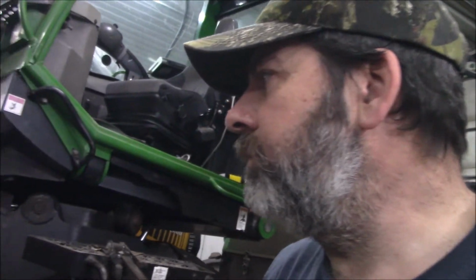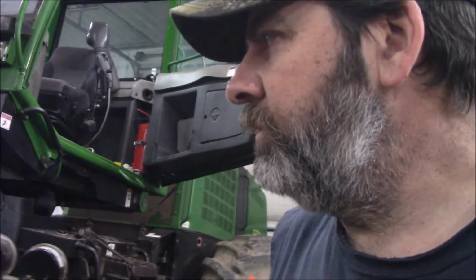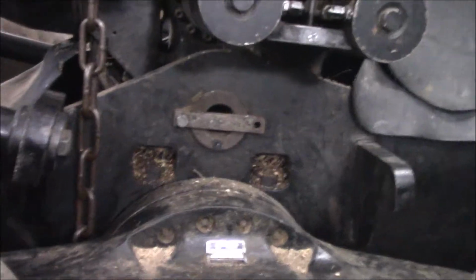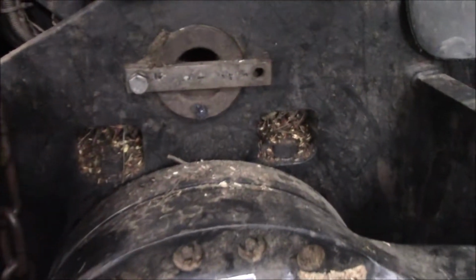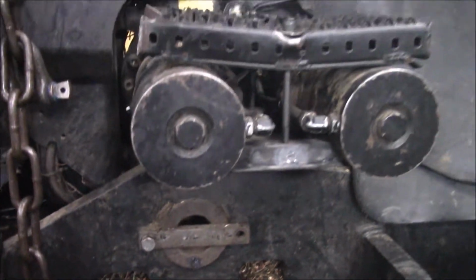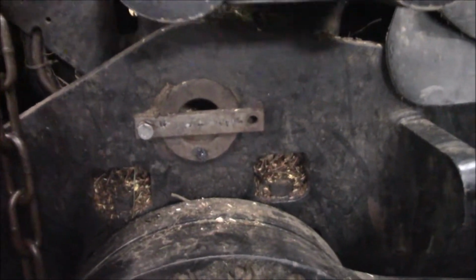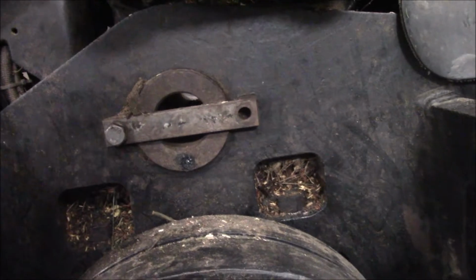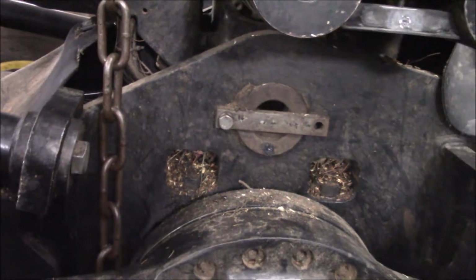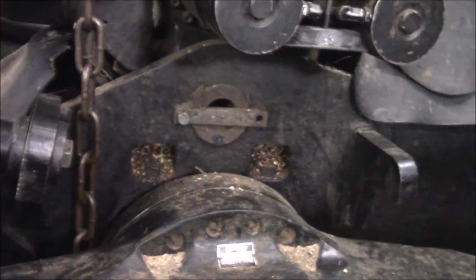We try to do everything. Oh, there's a problem I see that's got to get fixed. Look at that. When you're wandering around here, that's the pivot pin for the crane base. Now, either the bolt fell out or the bolt is snapped off because that pin is trying to turn. We will have to check into that.